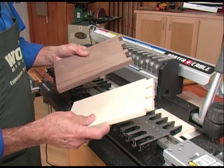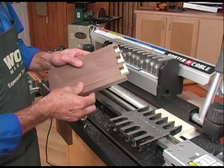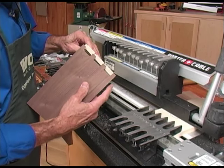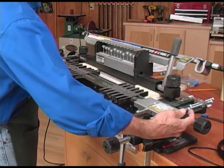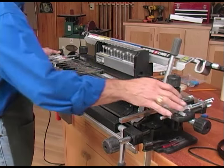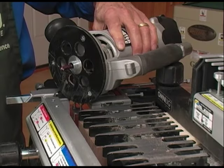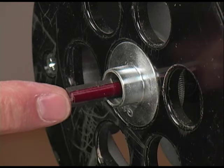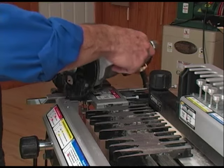Now that you've seen me make the cut on the tail board, it's time to turn our attention to the pin board. I'm going to reverse the order of the boards on the jig — instead of having a sample of the pin board sitting on top, I'm going to have the tail board, because the tail board's thickness determines how deep this cut is going to be made on the pin board. And the last thing we have to do to the jig is flip this template over — this sets up the fingers so we're ready to do the pin board. To cut the pin board, we're going to change router bits to a straight bit, and the distance from the base to the edge of the bit is an inch and a quarter. Your jig and stock may cause a little variance, so check your manual and run a couple of tests.